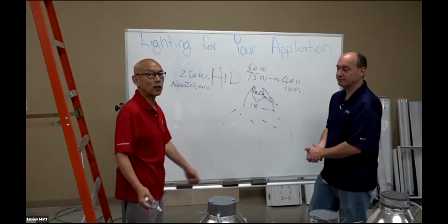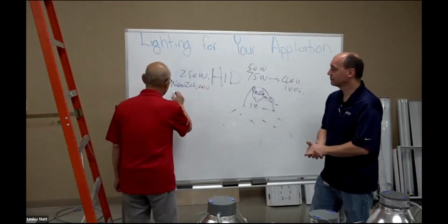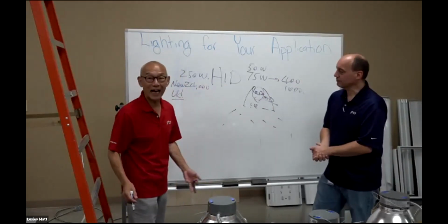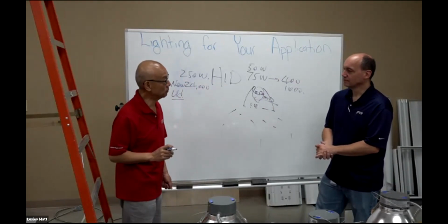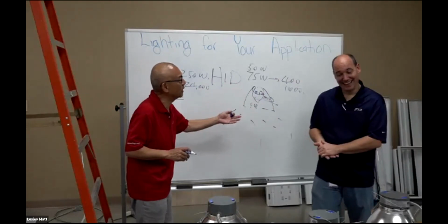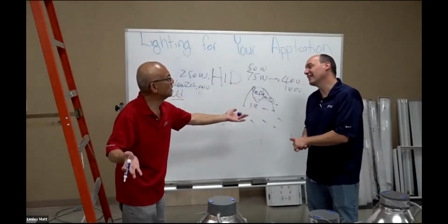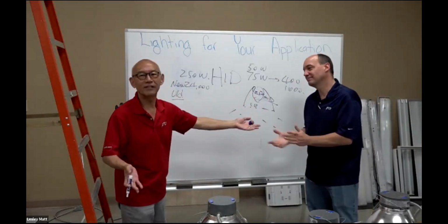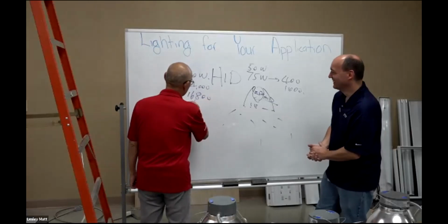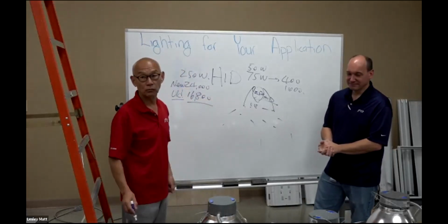After a couple of years, that new one becomes the old one. As you know, metal halide has a certain lumen depreciation. What do you think the percentage is? Be conservative, be nice to the metal halide. I think it's probably going to lose about 30%, so it ends up at 16,800. So this we call the new, this we call the old.